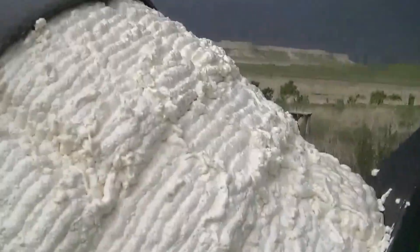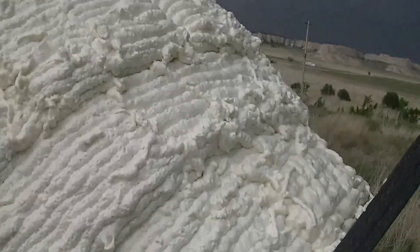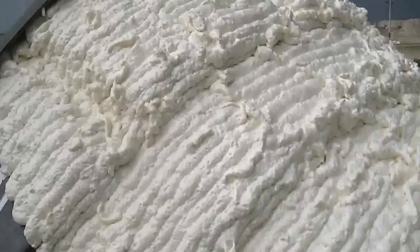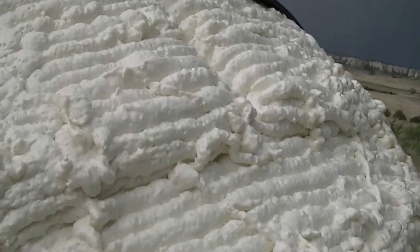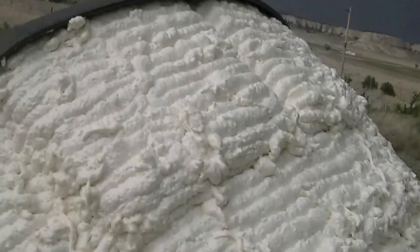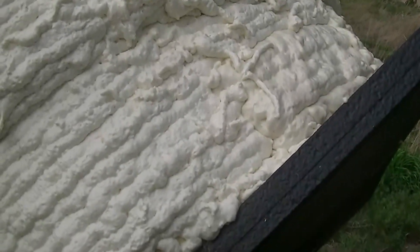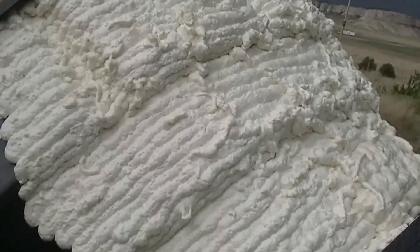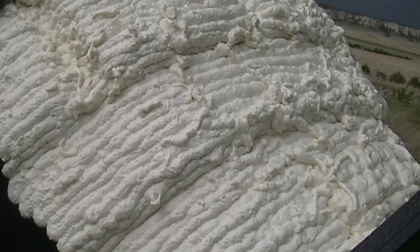I'm working my way around gradually insulating the outer surface with the Great Stuff — nice, messy, sticky, nasty stuff, so you need to be careful with it. It's going on better than I thought. Having used this stuff before, especially if it's warmer, it does move a little bit on you. I've gone section by section. One big can looks like it covers about three or four square feet — kind of hard to tell. I'm going to need about ten cans to go all the way around.